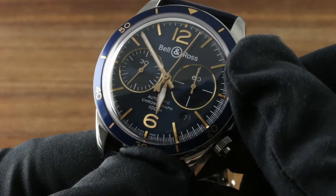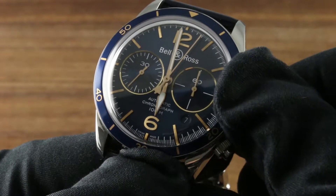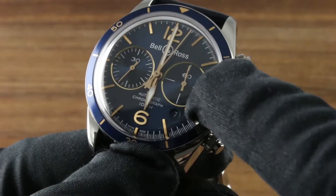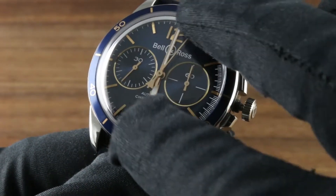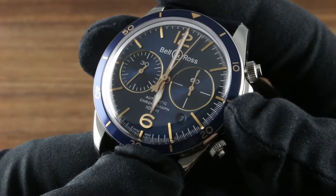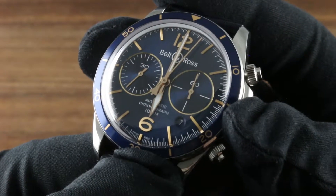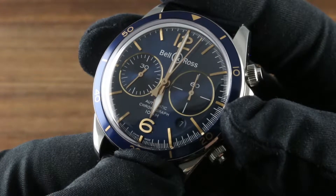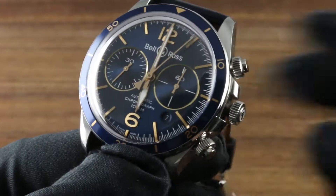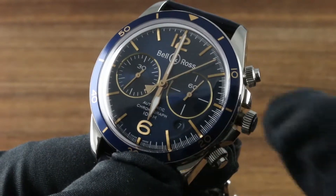For instance, if it's 5:59, we're going to set the watch to exactly 6 o'clock. Now that we have synchronized our seconds hand to the index at 60 and set our watch to the correct hour and next nearest minute, we're going to wait for our reference time — that atomic clock online — to catch up to the time we've set. As soon as seconds, hours, and minutes all match, that instant push the crown back in. Now you've synchronized the watch to a reference time.